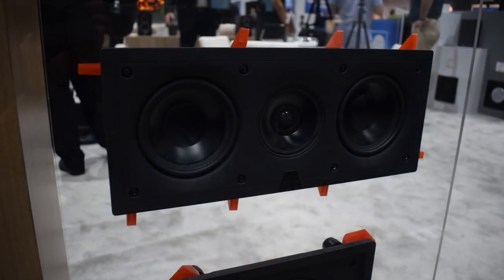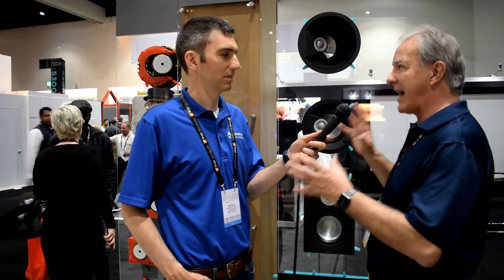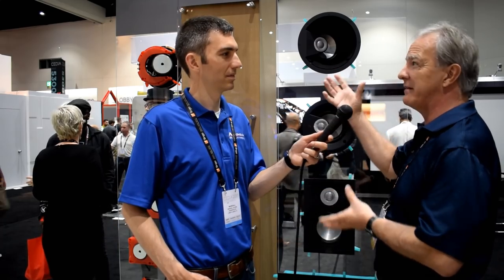In the case of the LCR, this is a concentric driver, but with an upgraded tweeter — it's now a metal dome tweeter for this series, but still with the aluminum woofers. And so it just goes from two to three-way. Right now the upgraded versions for that range for the in-ceiling are still two-ways. We are looking at a full three-way concentric version — there's a lot of engineering to do for all the mechanical design and the tooling to fit a three-way system into an in-ceiling speaker, so that will be a later proposition in that range.